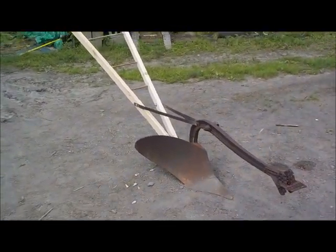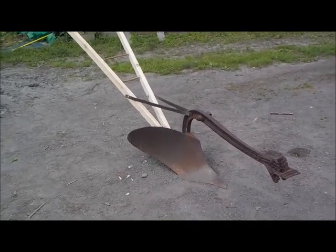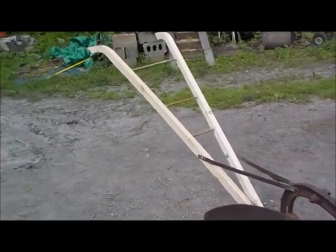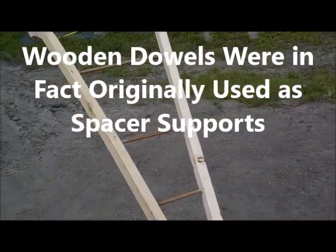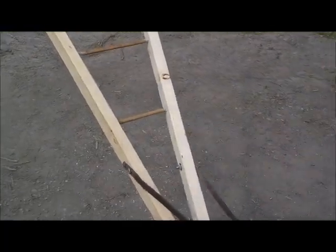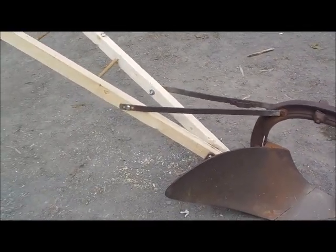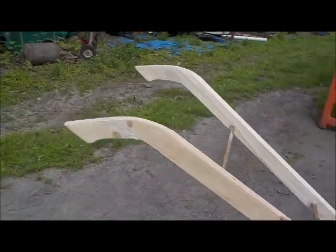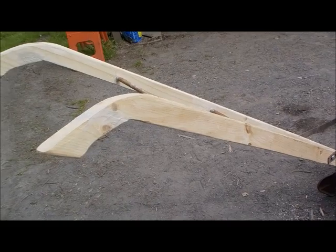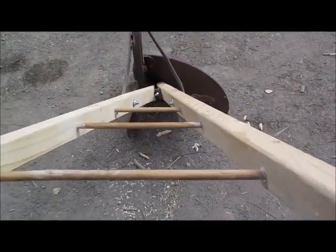The new handles are finished and installed, just letting some wood glue dry that I used on the dowels. Pictures of this type of plow I've seen either had a metal brace between the two arms or nothing. I think a plow this old would have had wooden dowels, so I drilled and implanted three wooden dowels for spacing and strength for the arms. She's all bolted up — two braces coming out and two braces inside the plow. The handles came out pretty decent; I had a couple little hairline cracks that concerned me so I filled them with wood glue. They weren't cracked through and through, but since this is a display piece it's fine.